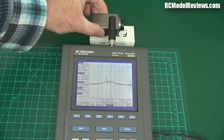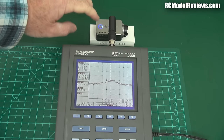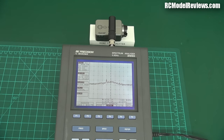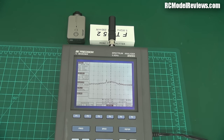Now for the new Runcam 2 HD: turning it on and the noise is a lot less — they've done a really good job. We're hovering around minus 100 to minus 101 dBm, which is a fraction of the noise the older Runcam and Mobius generate. Turning it off shows almost no drop in the noise floor compared to the other cameras. On UHF this little camera is the best I've reviewed so far. Also checked on 2.4 GHz — nothing there, as expected.